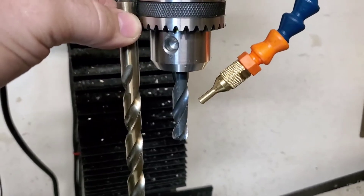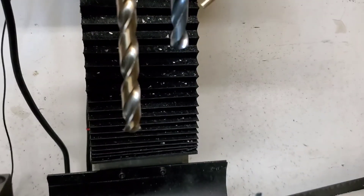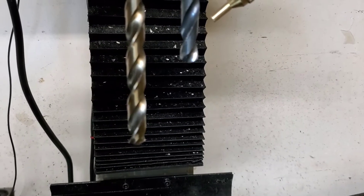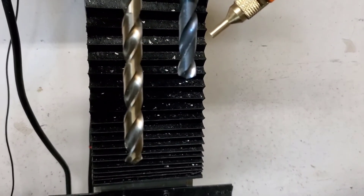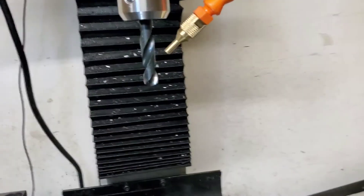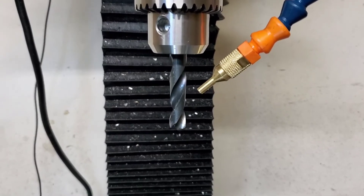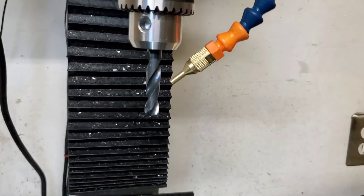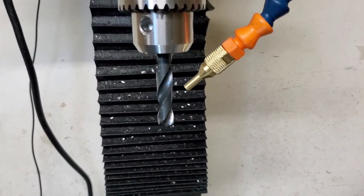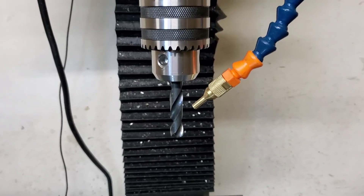I had that one choked up about that much — I went right to the top of the flutes. You can see it's about twice as long, giving twice as much flex. So I'm probably going to do away with my spotting program and go straight to drilling bolt holes, but of course that's going to be more R&D and more practice. Thanks for watching.